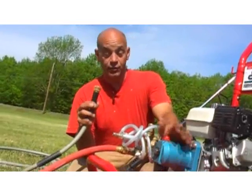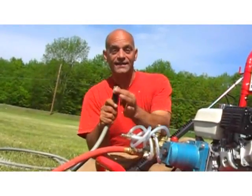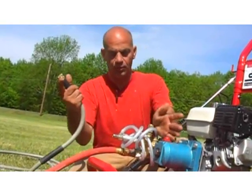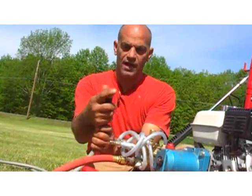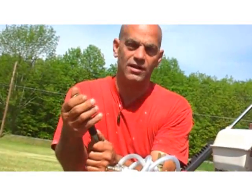Okay, this is one thing. Connecting a hose sounds real easy, right? Well, you got these quick disconnects. It's not always that easy, believe it or not. But once I show you once, no problem. Look on the end of the hose, you have a coupling here. This is the female of the coupling. You got this little piece that springs back here.